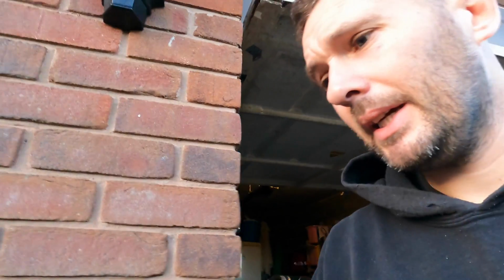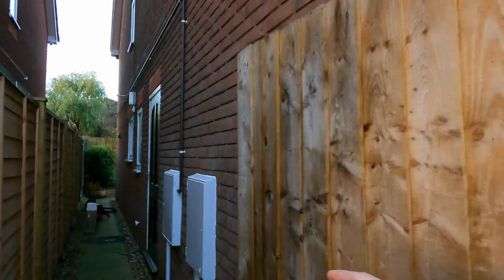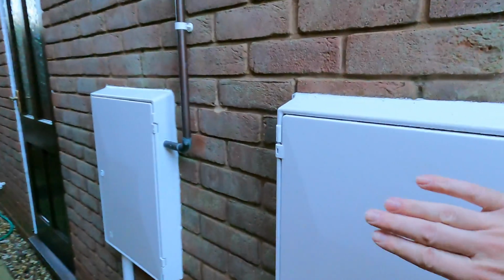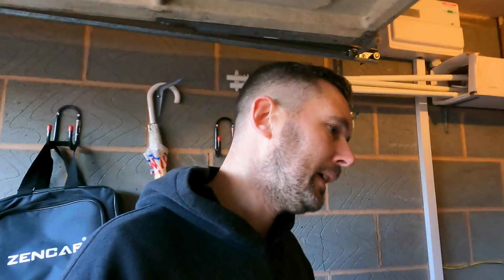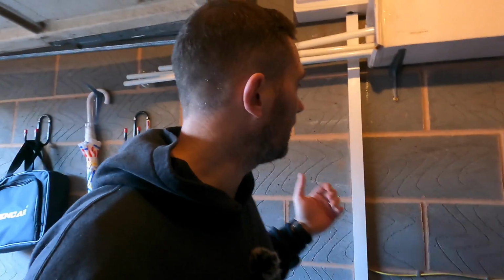So I've also got a 100 amp supply here, and my main meter cupboard is here, which is perfect. So we're going to be splitting the tails. We're going to have to split the tails on this one to fit another little separate board purely for the EV. A little bit disappointed in what the situation is. I've tried to help out the customer as much as I can with the pricing, things like that. It's a little bit disappointing really, but it's happened now.